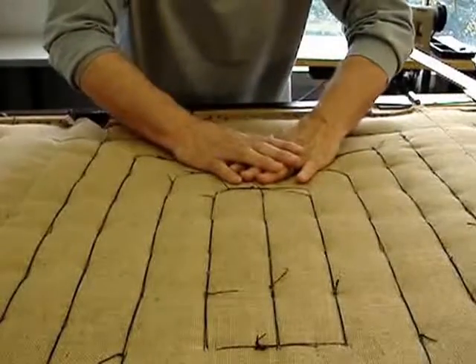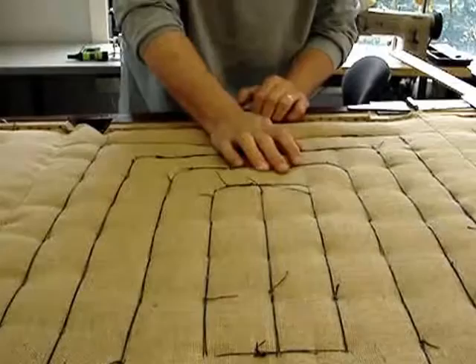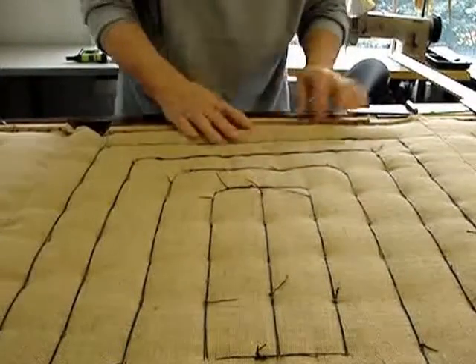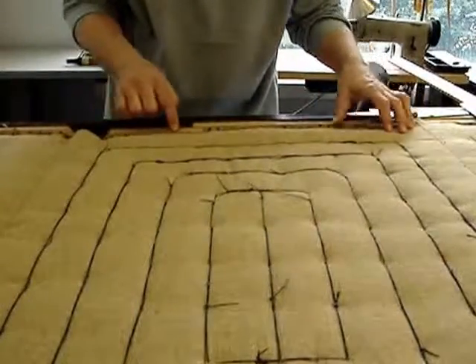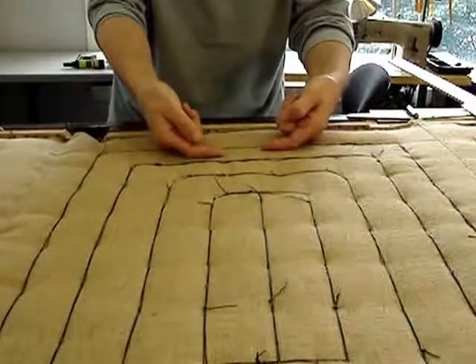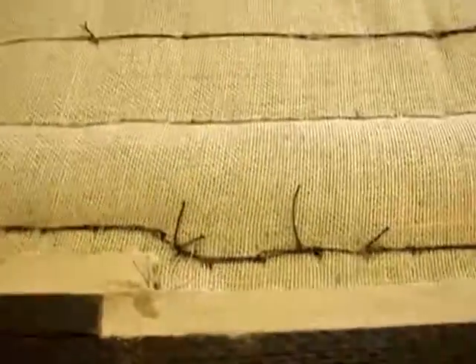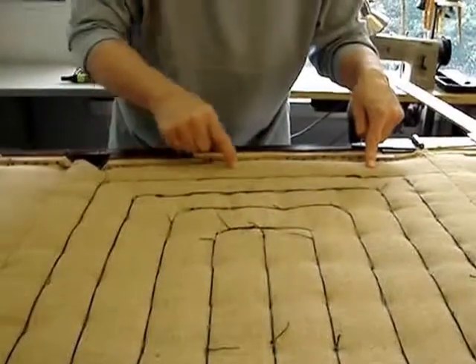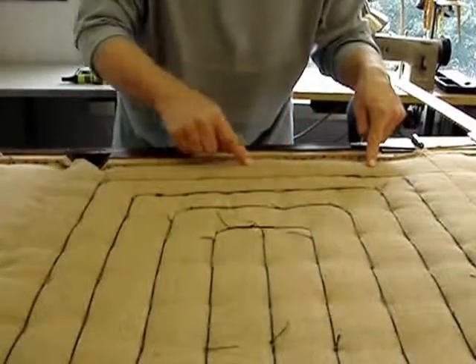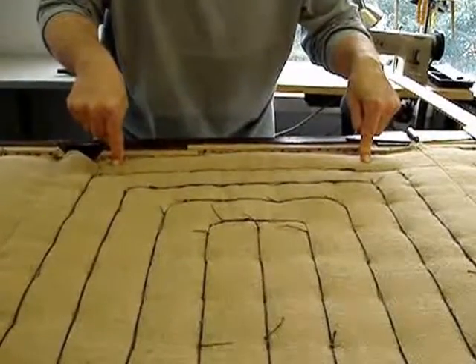Every time that a person sat down on the edge, it pulled the cloth until it simply ripped it away from the wall. Now, setting in the additional tacking strips will help because the ticking and the show cover will pull over the top and tack to the upper surface. But the addition of these blind stitched edge rolls has really saved a great deal of stress on the ticking and the upholstery fabric.